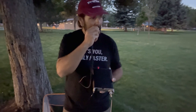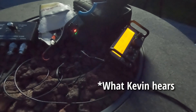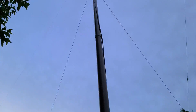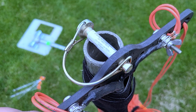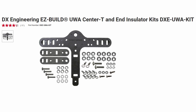I am so stoked, because as far as NVIS goes, this is great. What I'm using for my antenna setup is a tilt-up base that I put together using a cutting board from the store, four tent stakes, and my military fiberglass tent poles. For the feed point I took a piece of coax about six inches long, split it between the center conductor and the braid, and put ring terminals on them for the connection. The T-fitting the coax hooks up to is a part I got from DX Engineering a few years back — link in the description below.